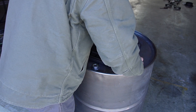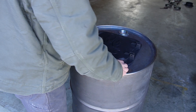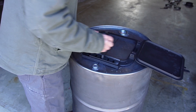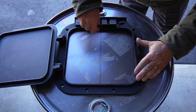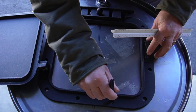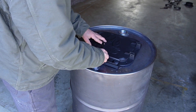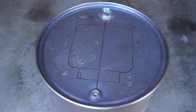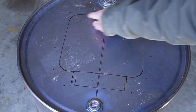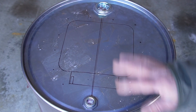I'll get my door lined up, centering it between the two bungs in the barrel. I might go a little bit higher towards the top one because there's a curved section, but you mark the cutout for the inside. I'm also going to mark my holes and the vent openings, giving a little clearance and joining those lines. Then I'll mark where my stovepipe is going to go, get my feet mounted, and start cutting everything out.